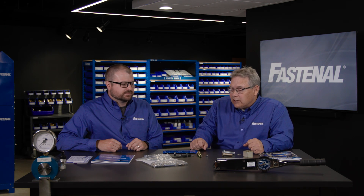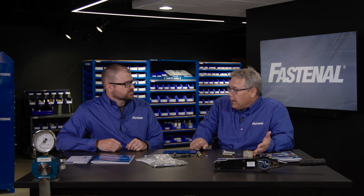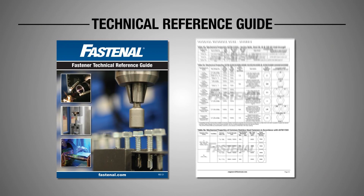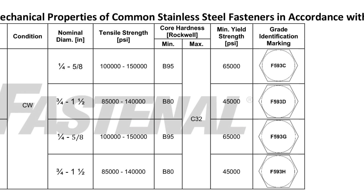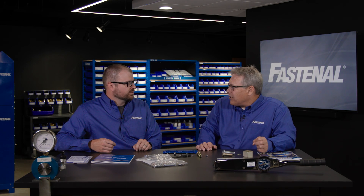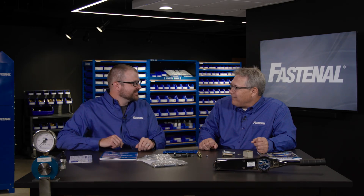Let's move on to stainless steel quickly. In the inch world, ASTM writes a standard F593, and that's probably the most common standard and marking people will see — you will see F593 marked on these fasteners, along with a letter after it that tells you the diameter size range. There's also ASTM A193 and A194, where you may see something like B8 or B8M. The concept is that the markings teach us things — not that everyone needs to memorize all these standards. Why memorize it when you have a technical reference guide? You can find that on Fastenal.com.